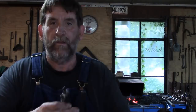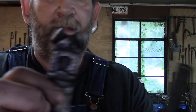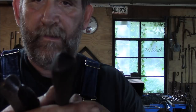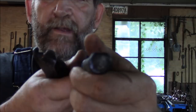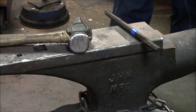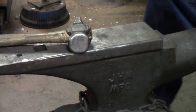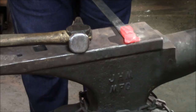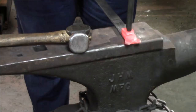The next thing we want to do is make the nose. The nose is made with this triangular shaped punch — if you can see it real good. On the drive end, you'll see a flat right here, and that tells me where the top of the nose is. So it's an indexed punch. We're going to make sure we've got it indexed, put that about right there in the middle, and drive straight down.